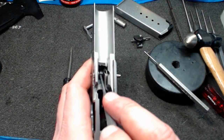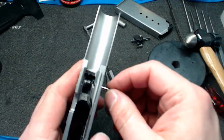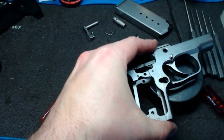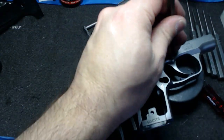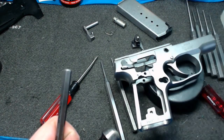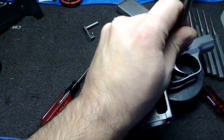The coil has lots of room around that plastic to move. So the big spring, it's not like having a tight spring really close in diameter, that coil. This one is a little friendlier. So now that I've got that, I can really just drive this through. And I'm not going to meet any kind of unexpected strange resistance because the trigger itself, since it's solid on both sides and already through the pin, is going to be aligned. And I don't have to hold any of the rest of the parts in once that's caught even just a little.